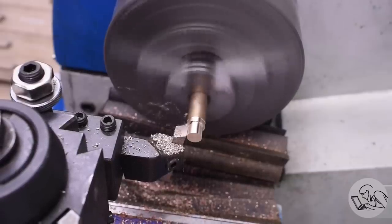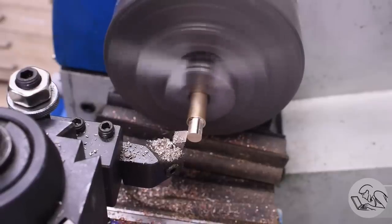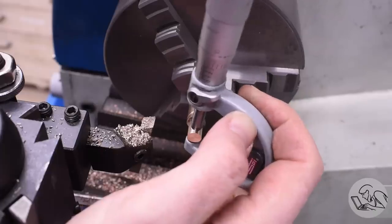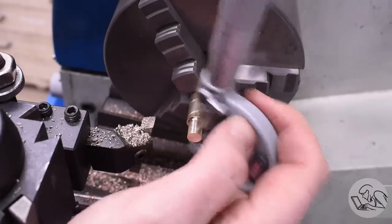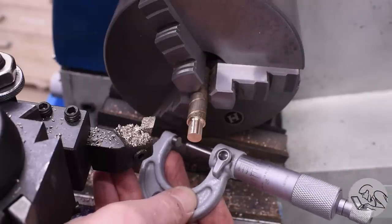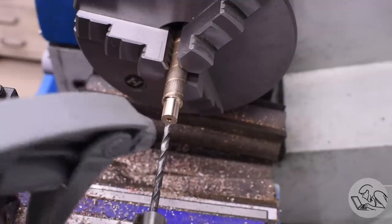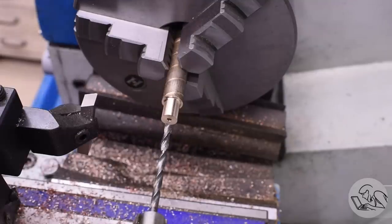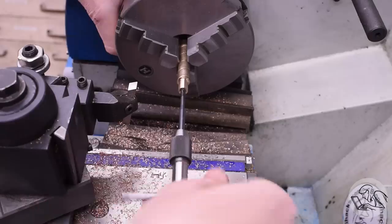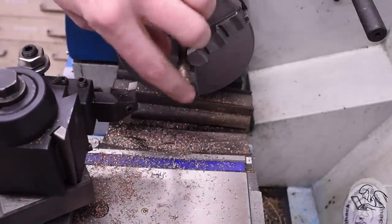One of the things about a boiler is that it's not just a functional part, it's also a structural part. Pretty much everything on a locomotive attaches to the boiler. It's considered part of the frame, so this is a good example of that, which is slightly annoying as a model builder because all of these attachment points are potential leaks in the boiler, unfortunately. Now, Kozo has done a lot to minimize the amount of things that attach to and go through the boiler to make it easier for final silver soldering, but some stuff like the smokebox studs are kind of unavoidable.